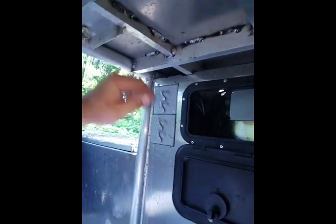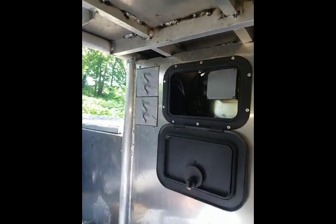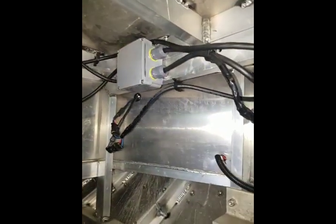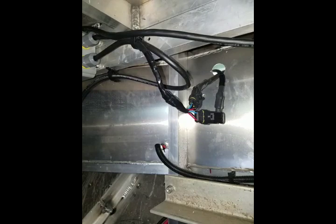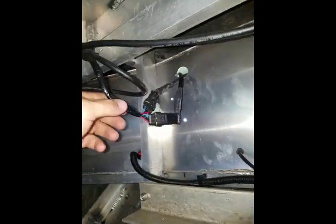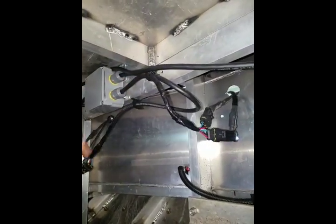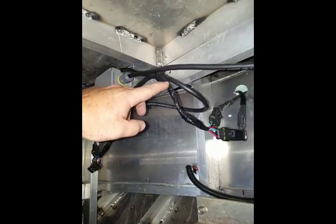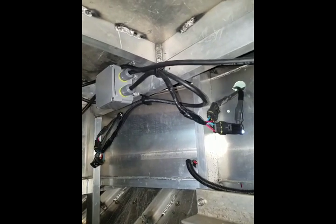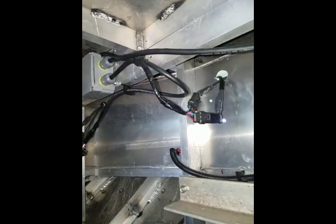I would hate to have to come back here and throw one switch, and then I lose an entire quadrant of my boat for lights for the rest of the night. So with this setup, I can keep running all night, even if I drop a light or 2. Now, as far as the wiring itself goes, once again, my trunk was 10-3, but these drops are 14-3. A lot less power on each one individually versus all of them together for the trunk.